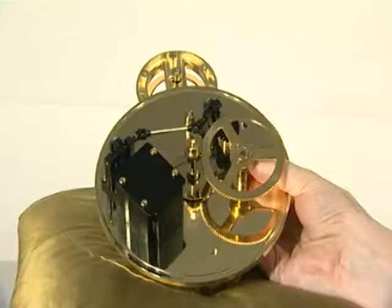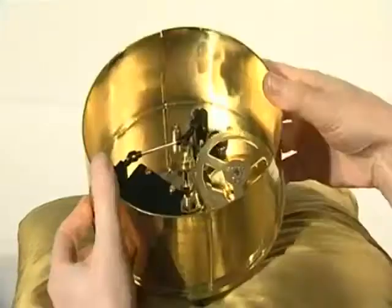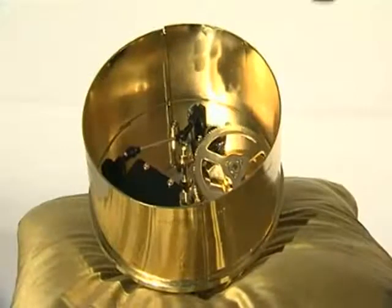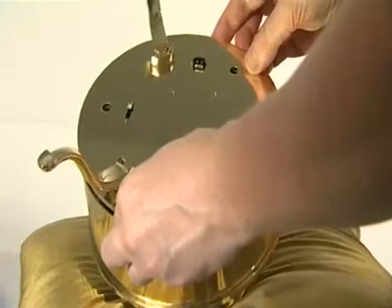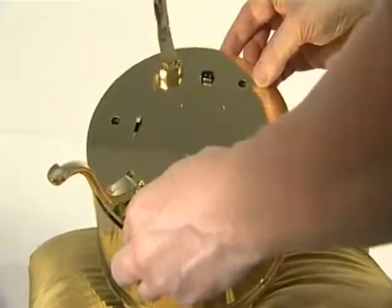This is best done by first turning the upper assembly upside down. Ensure all loose parts are removed first — you'll need to refit them later. Position the two drum sides in the channel in the engraved plate as described previously for stage 4 phase 2, noting their correct date alignment. Lay the bottom plate with the motor, control system and legs over the drum sides, ensuring the sides fit in the channel around the outer edge of the bottom plate.